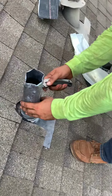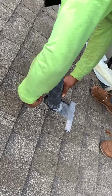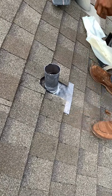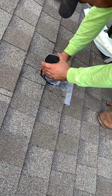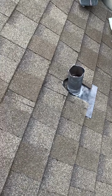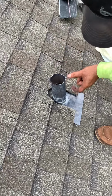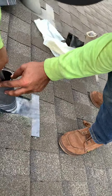And these pipes are made of lead, so they're very malleable. They're easy to cut. But we use the lead over the rubber and plastic because they're never going to crack or break due to so much sun exposure and heat here in Texas. So we'll go ahead and kind of mold some of that over. Maybe we cut four cuts and then fold it in and kind of overlap it as much as we can inside the other pipe, you know? Yeah, probably. Just enough to fold this into the other one just by like that much, maybe.